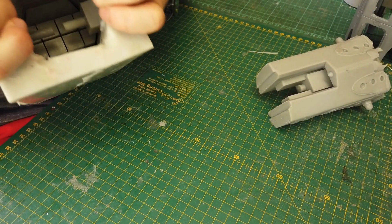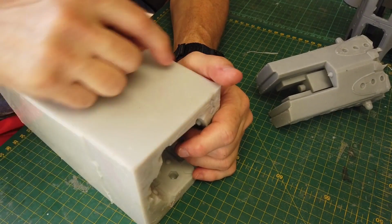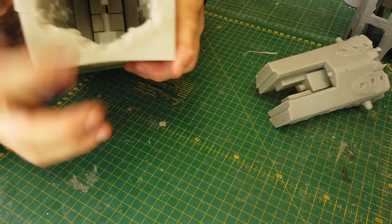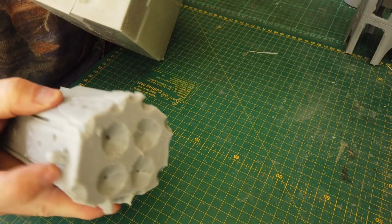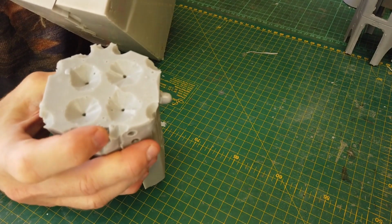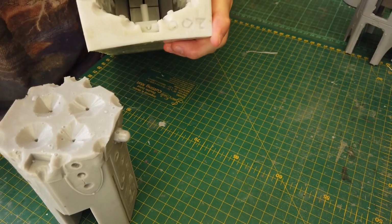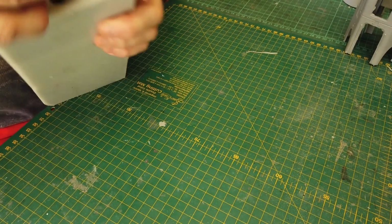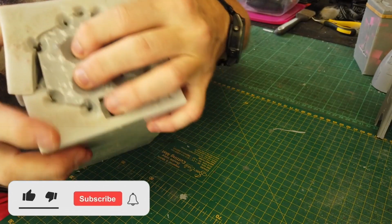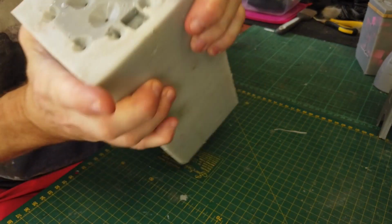And then when the part is together with this inside, rubber bands, if it's a high mold this way, you need to make sure rubber bands are all the way around the main part, else you're going to have leaking of resin out the bottom. Okay, and I've got 2 big keys on the side, which are these nuts. And it only goes in one way because I've got the square filler, which corresponds to over here. So it goes in, and then get rubber bands, and then Bob's your uncle.